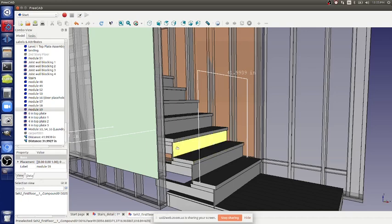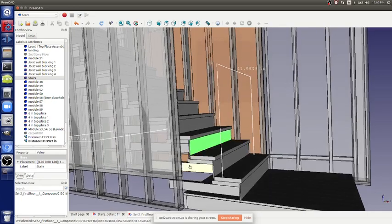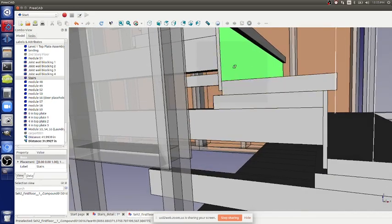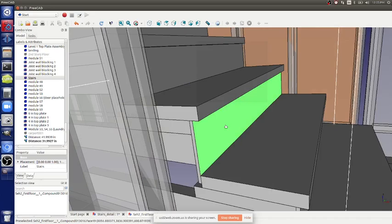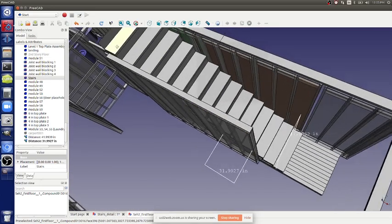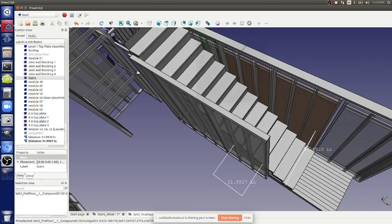Are you suggesting that we install the kickboard as a way to measure how far up we go? It might help, but okay, so here's the deal on that. Take measurements on the wall model. There's a reason why there's a tiny gap there. That's just adjustment. But the idea is, if you use this to get your rise here, you can't, because the last step has to end up exactly at the second floor level. So that would be really hard to do. You do measurements. So you measure every position and then make sure it ends up at the top.